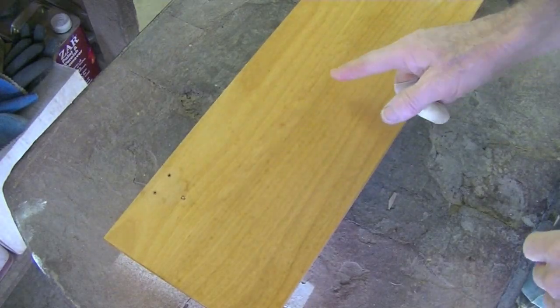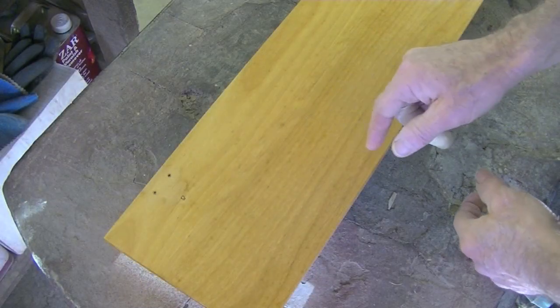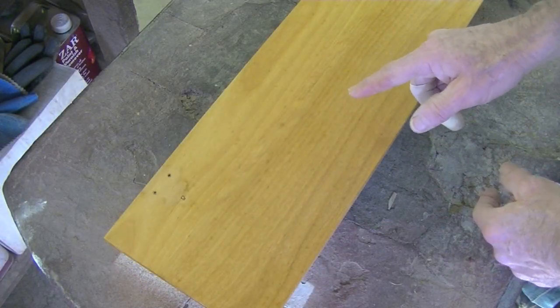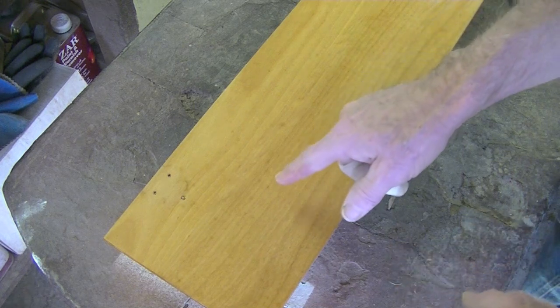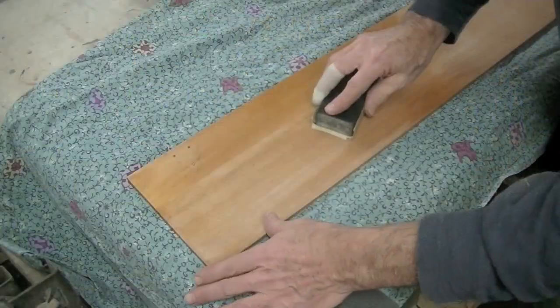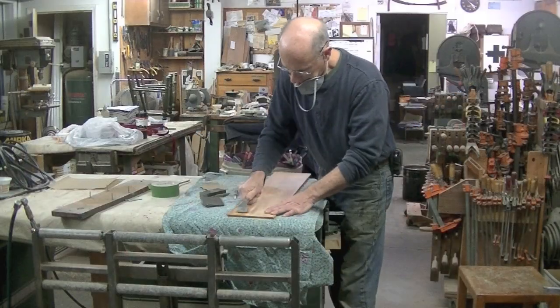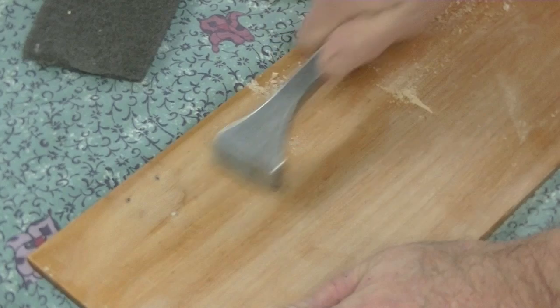As I started to brush shellac on the outside of the fallboard, I see all these little water spots. I could see them yesterday. When I washed it with bleach they didn't seem to disappear instantly, but this morning when I came back in they seemed to be gone. I sanded this and I couldn't see them, but now I can see them. So I sanded this fallboard a lot more until those spots are gone. The sanding wasn't really going so well — the shellac was clogging up — so I decided to try a scraper. That seems to work a lot better. This is where the worst spots were.